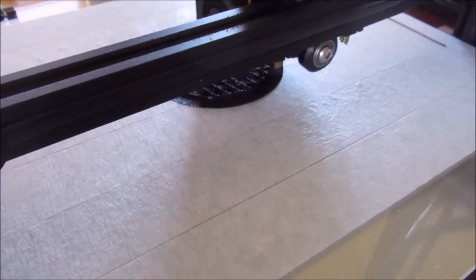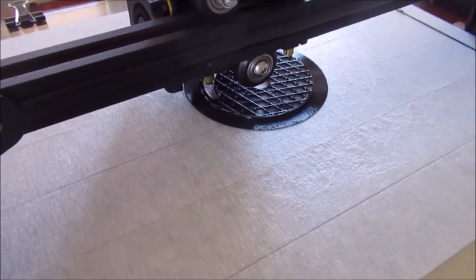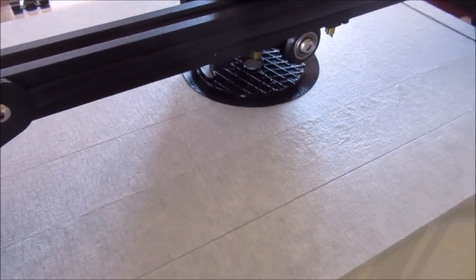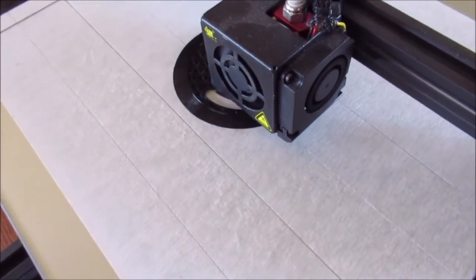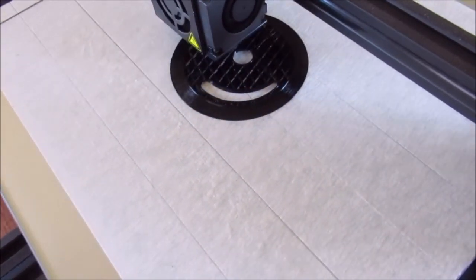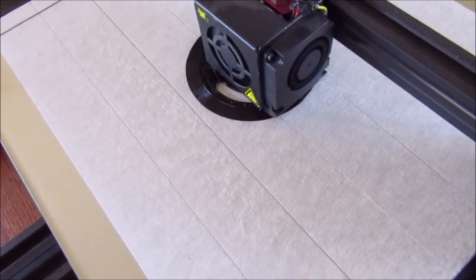But I ended up doing, I think I lofted it just the same, but my opening for the intake inside the pump is larger than the outlet of the pump. See, whatever's laying flat, like whatever's touching the tape from the other side, that's the size of the opening, and it's obviously bigger than the outlet, sorry. So I'm going to have an unbalanced pump and probably some cavitation, but I'm just building this for proof of concept. I'd have to somehow equalize these ports to be able to move the same amount of water per revolution.